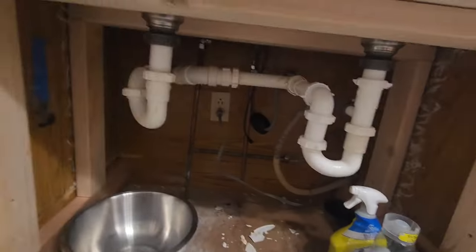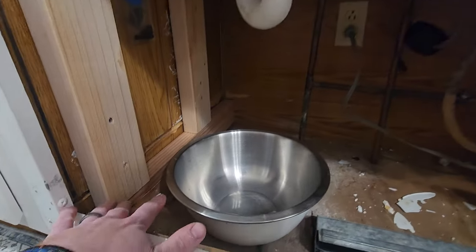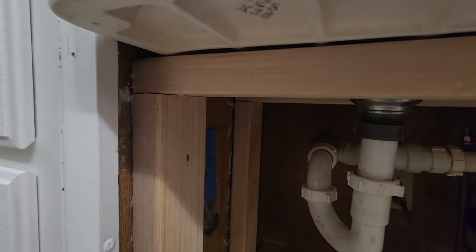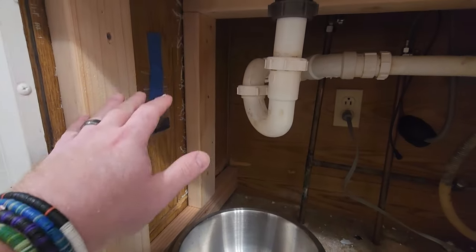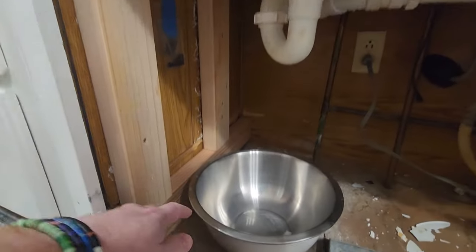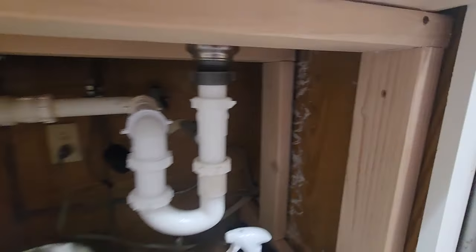Underneath, what I ended up doing to actually get this set is I wedged underneath these boards. I actually used a crowbar to lift this side up, made it real tight. And I just kept looking at the top to make sure that my edging was even around the edges. So I kept lifting up, pushing up, and when I had it ready, I just zipped it in so it was high. I moved my board underneath. You can see I put some shims underneath both sides, but that is how I got it all in.